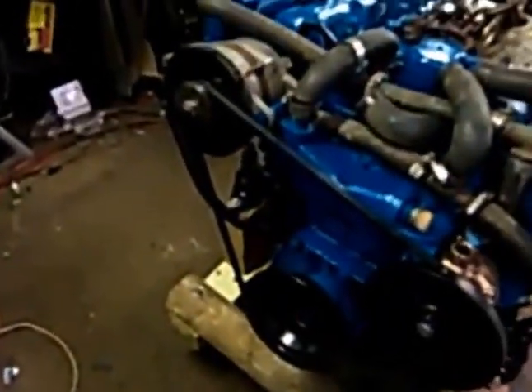I did get a brand new alternator belt the other day and put it on. Today I hooked up the hoses for the cooler lines, got the standoff put in, and put the alarm in. This is the alarm — I didn't have this previously, all I had was just a plug there. But that's actually off the pressure side of the transmission pump, and whenever there's no pressure there it'll set off a buzzer at the bridge.